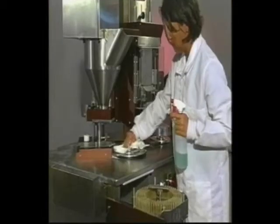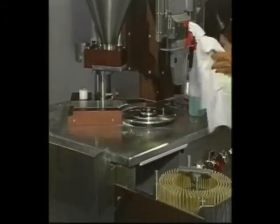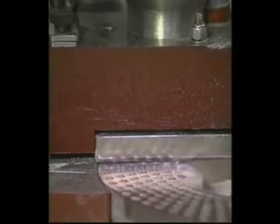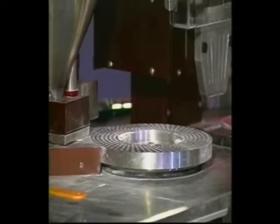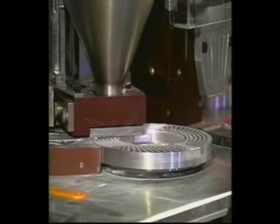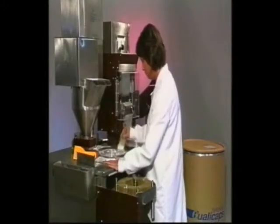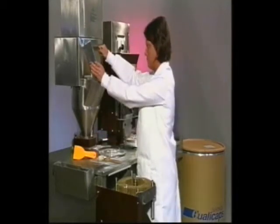In addition to cleaning the hopper and auger, you might be expected to complete several other common maintenance tasks — your company will dictate all cleaning and maintenance practices at your facility. To maintain your Model 10, it is vital to keep your tabletop and filling ring clean. The clearance distance between your rings and other machine components like the powder shoe is oftentimes incredibly small. If you have any residual product on your rings or table, you run the chance of changing your clearances and damaging your rings or capsules — this is a costly mistake, but you can avoid it by keeping your work area free of residual product. Use a soft brush to push powder into your powder tray or use compressed air to blow powder away from your work surface.